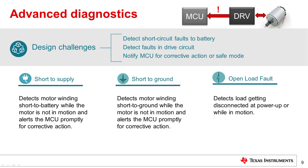BDC and BLDC gate drivers integrate diagnostic circuits to detect circuit continuity faults such as open and short circuits. These circuits will prevent the MOSFETs from turning on in the presence of faults, thus protecting the control module from damage. In addition, products that offer failure mode distribution and pin failure mode analysis information can help you design a control module in compliance with the ISO 26262 Automotive Functional Safety Standard.